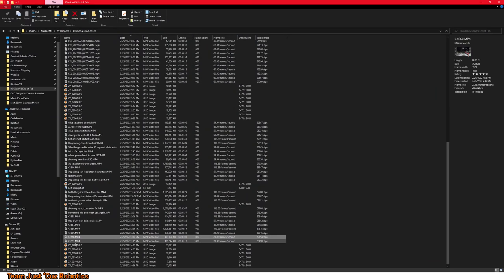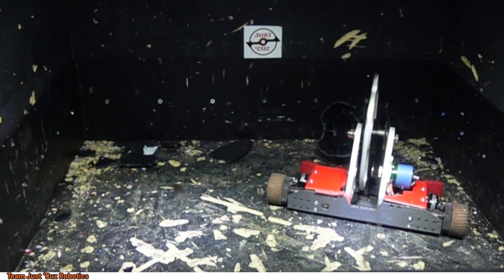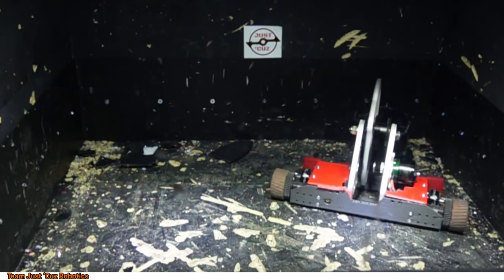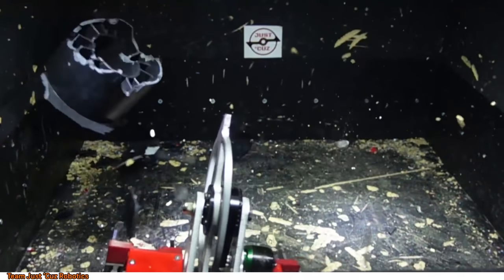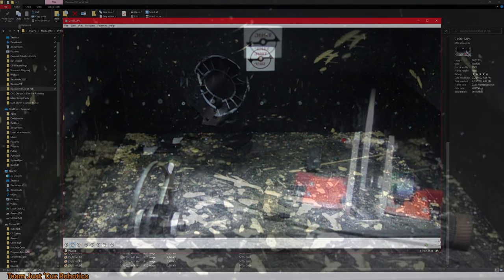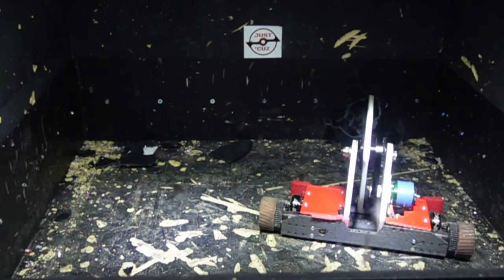So yeah, I mean, that's pretty much all I've got for today. I will report back when I have some new belts to try out and see if those fix the problem that I was having with the belt snapping, but at least I was able to suss out some drive issues and potential for more drive issues. I filled the heat shrink that was around where the signal wires are on both speed controllers for the drive with hot glue to better support the wires to prevent them from popping off again. And obviously I replaced the dead speed controller that had a capacitor pop off.